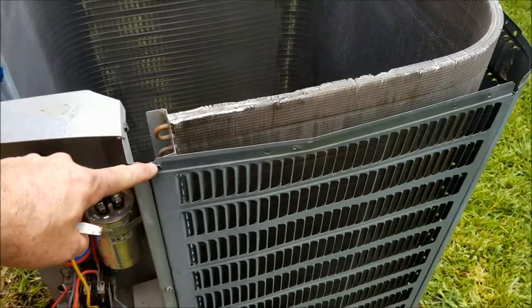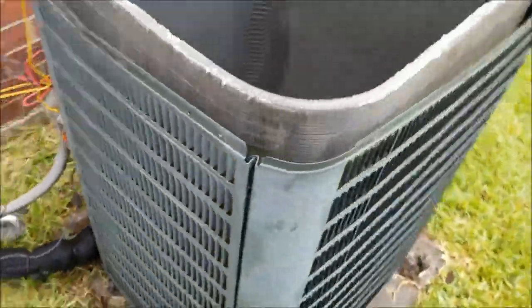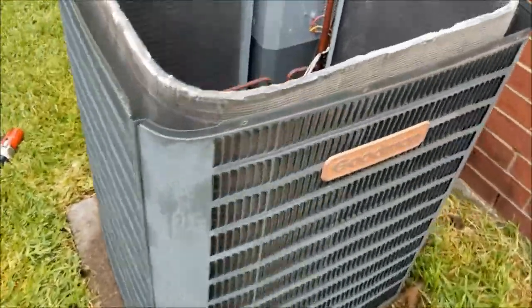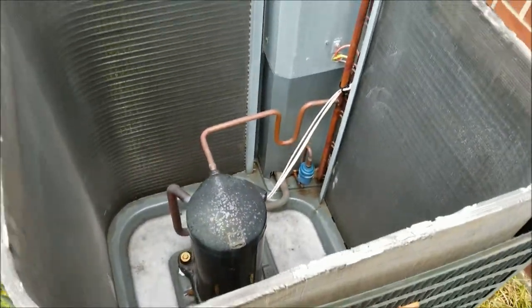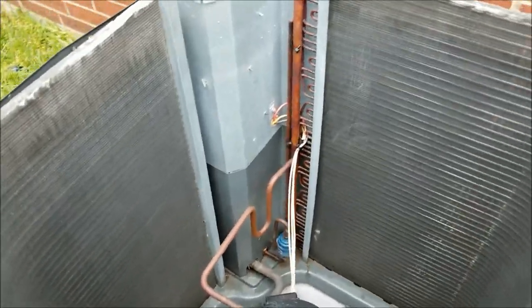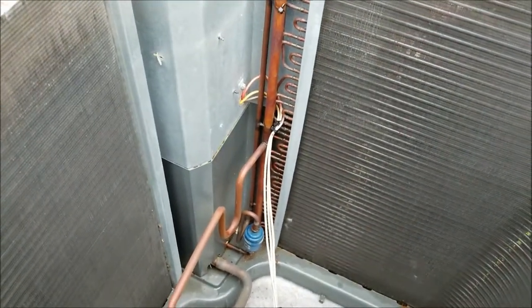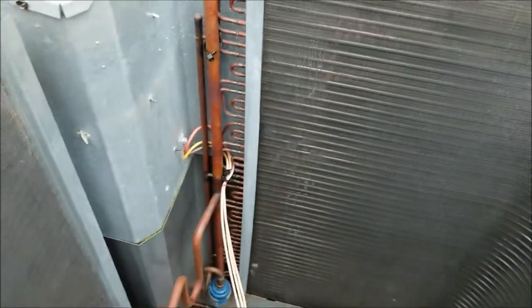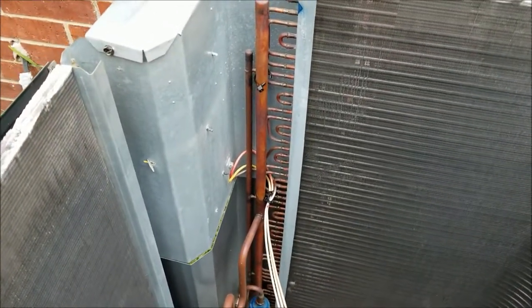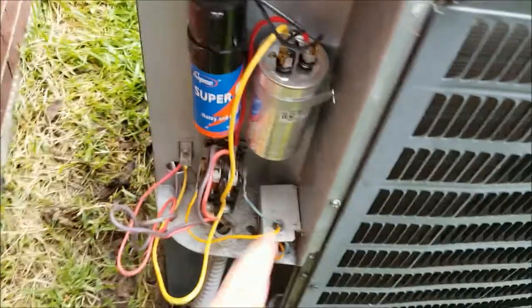I just put the sides back on — basically we just put it back in and put the screws back in, line everything back up, all the way around. Inside's clean. Now we've got to run the wires to the fan through this hole right here before we put it back on. I'm going to run the wires through here — see this zip tie that had been cut? I'll probably zip tie it so the wires won't get pulled into the fan, then bring them around on the outside, zip tie this mess together, and reattach it to the capacitor, which is right here.